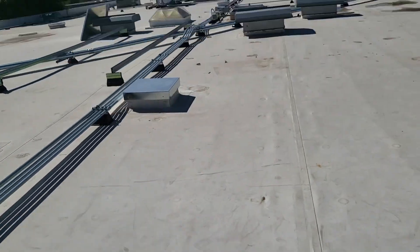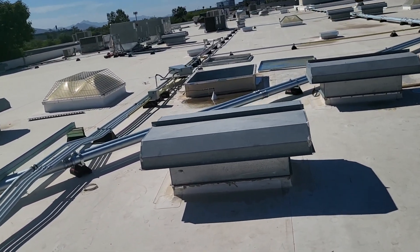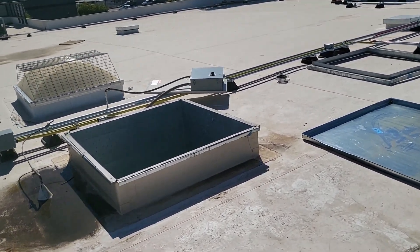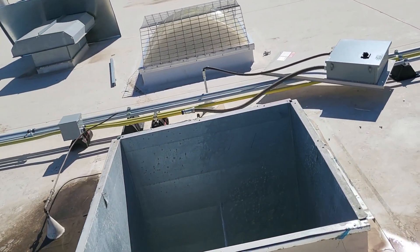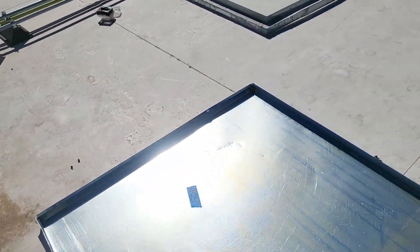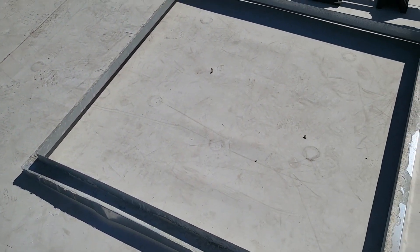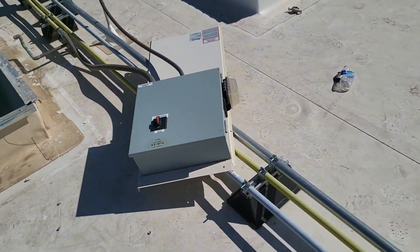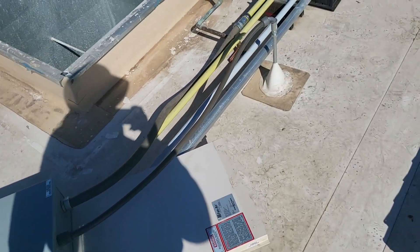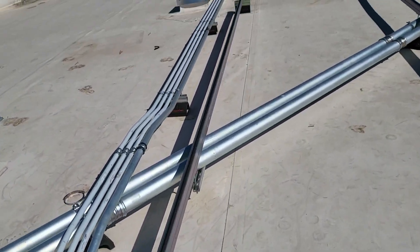That's what we're going to be left with until we come back with the new 12-and-a-half-ton air conditioning units — they're really big. We still need structural reinforcement; they need to reinforce the framing underneath to withstand that weight, so it won't be for a little while. We are not doing the electrical either — the new units are 460 volt and this is currently 208, so they'll have their electricians handle that for both of them.